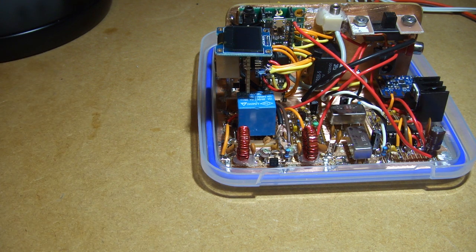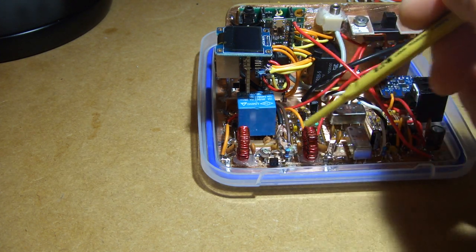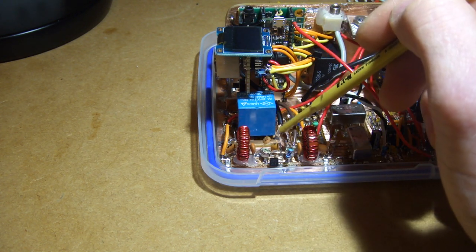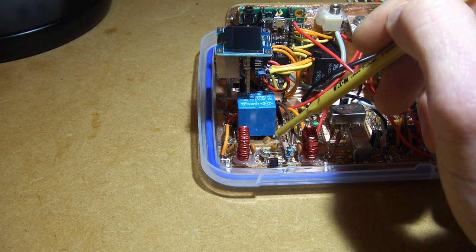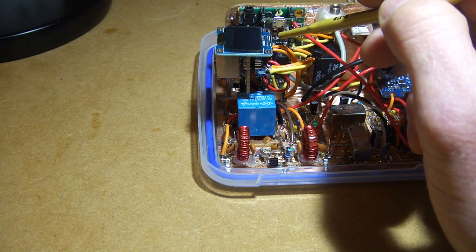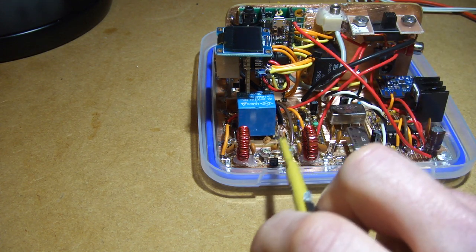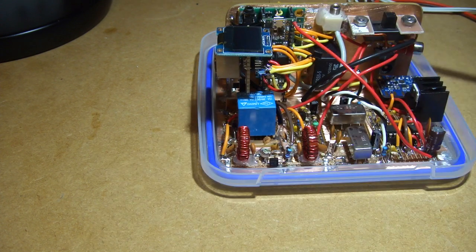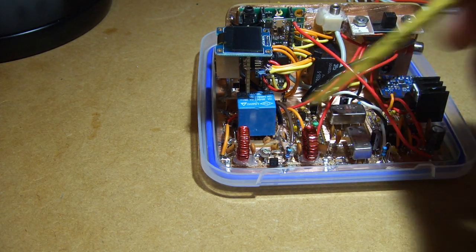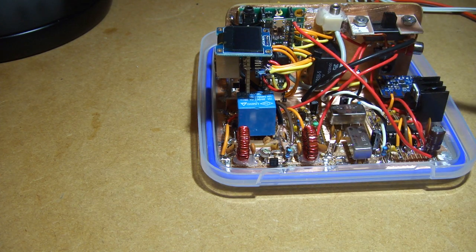In New Zealand we have a mountain safety radio service which runs at roughly 3.2 MHz. So what I've done with this bandpass filter is I've got a couple of additional capacitors that just sit in parallel with these two here, and they get switched to earth via a little transistor to put them in circuit. Through the brown wire with the Teensy, when the frequency drops below 3.6 MHz, five volts onto that turns that transistor on, earths out those legs, and those capacitors are now in parallel — it shifts the whole bandpass of that filter down 200 kilohertz. Above 3.6 MHz, that transistor turns off, those get taken out of the circuit, and everything shifts back up again. So that was a reasonably good way of allowing that one bandpass filter to cover all the way from 3.2 to 3.9 MHz, which seems to work quite well.